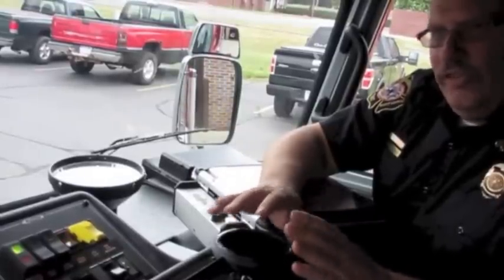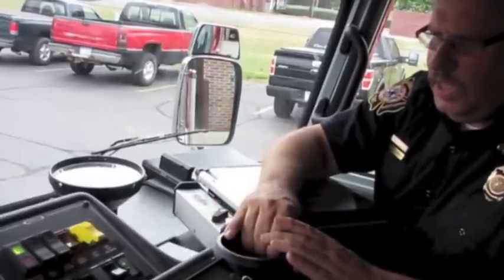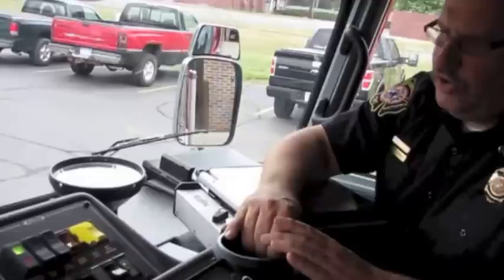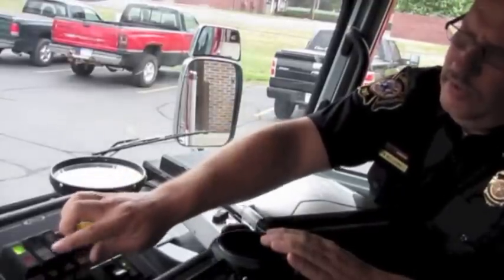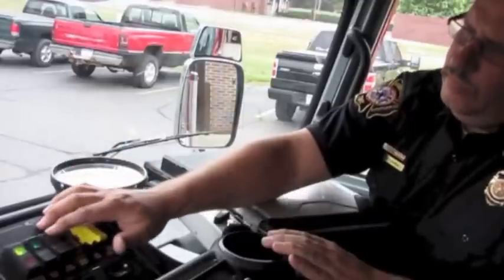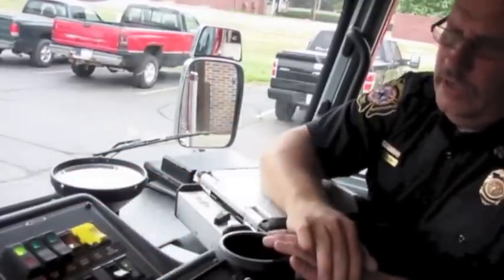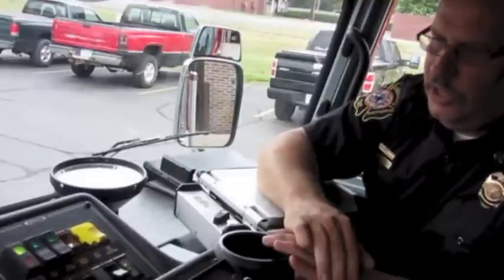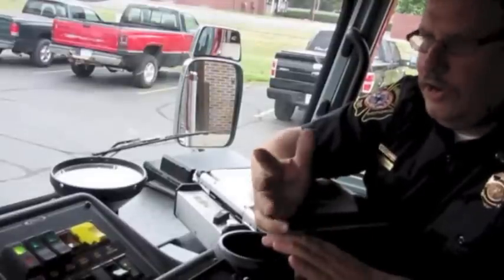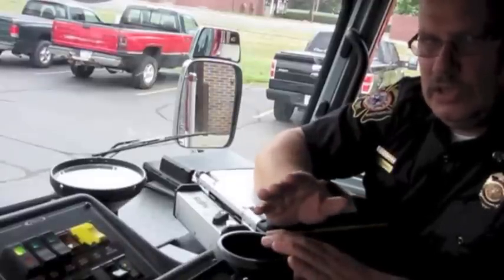What we can do now is, as the driver is approaching the accident scene, once he is below 1000 RPMs he can shift the water pump on by just pushing a button — pump is in gear. Push another button, foam is in gear. Third button, now the PTO is in gear. I have electric, water, foam, and my hydraulic tools before the parking brake is even set on this truck.